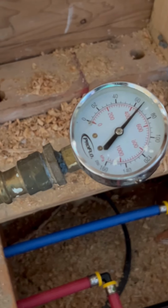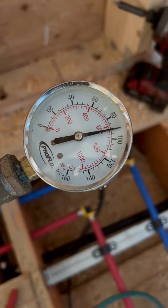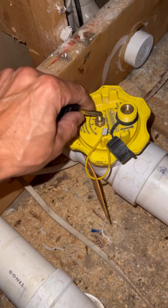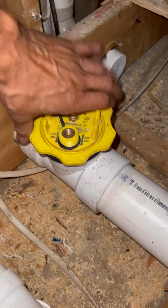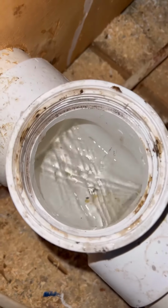And that's my cordless Milwaukee compressor. I'm all over the map today. We got to fill up to 125 PSI per Massachusetts state code. So all you clowns out there asking me why I got to go that high, that's just what you got to do. So now for everybody who's wondering, the inspection passed, and now I'm breaking it down so they can put flooring down. And then I'm going to have to come back.